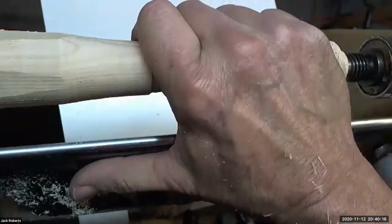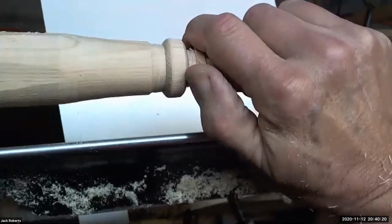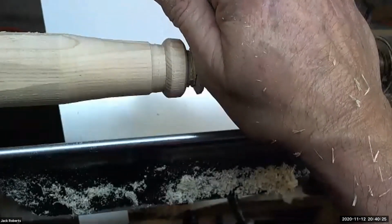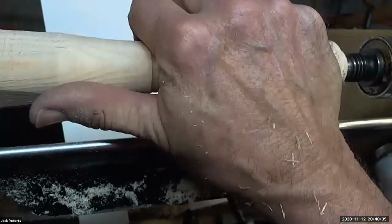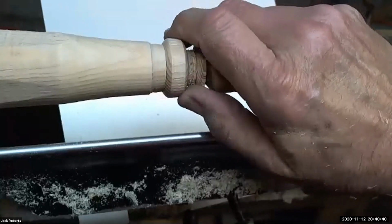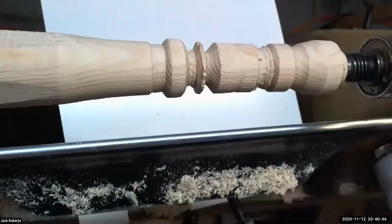unless somebody has a comment or wants to ask another question or wants me to show you something. Jack, how about when you use a scraper? Some people say do it at a 90-degree angle, tip it up. Well, I discovered that a negative rake scraper is a scraper that you don't have to tip up. If you want to use a non-negative rake scraper, like this right here,